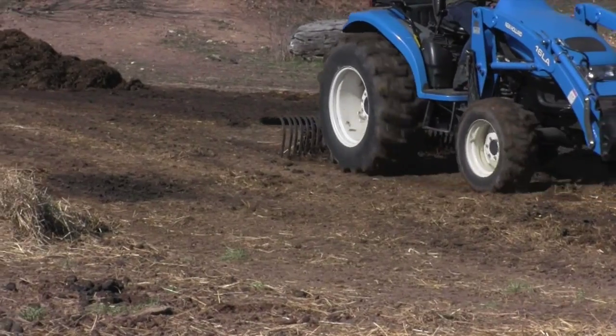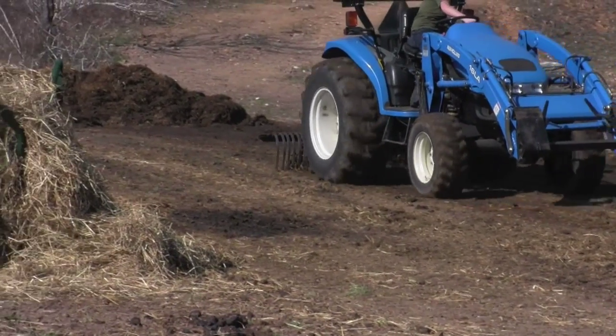Regan's got to go, so we're going to get her opinion on what worked and what didn't with the landscape rake. Regan, what did you find out about trying to get the stuff out of the barn lot? Well, I started off going really fast and the rock rake would just build up and then ride over it. Then I went slower and slowly lifted the rock rake and put it back down to rake it. In the bumpy areas I'd go really slow to build everything up, and in the flat areas I'd go fast and it would break everything up without losing the pile.